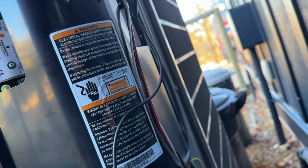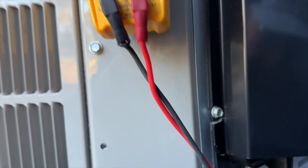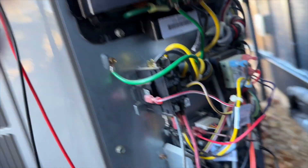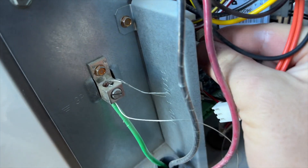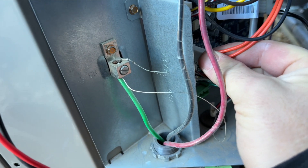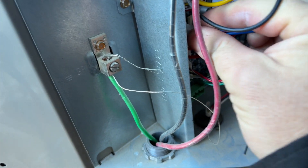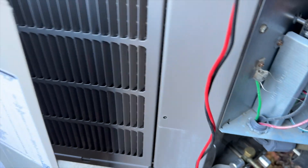So right on the compressor - the inverter board does need to be replaced, and you usually do that anytime you change the compressor. But all the parts are under warranty, so I still don't understand why it's 20k. Compressor is failed, inverter board does need to be replaced. As for the flush, I don't know why he unhooked all this stuff - he unhooked absolutely everything he possibly could have; he just wanted to make sure he could get that sale.